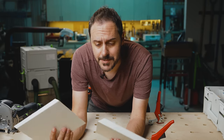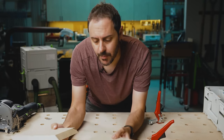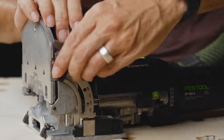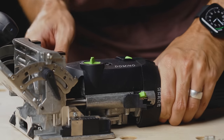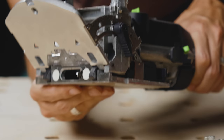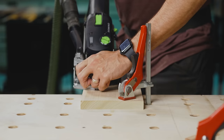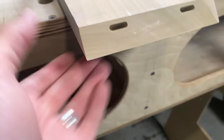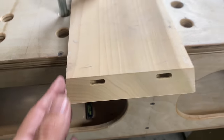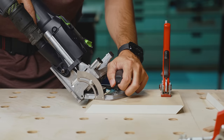I'm not the biggest fan of miter joints because I can never get them tight, so we're going to try this with a 5x30 Domino. The 5mm cutter head is already installed. First, set the fence to 45 degrees. That lets it bottom out — you get metal on metal contact right there. Tight setting, 15mm depth. I'm honestly a little nervous about this one because I know you can cut through. Referencing the side tabs is really cool — no measuring.